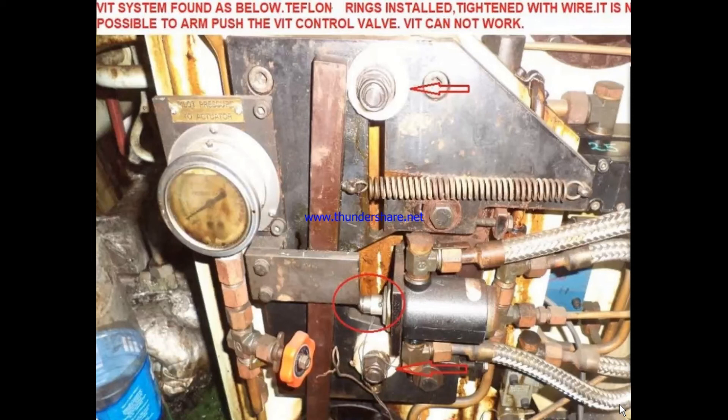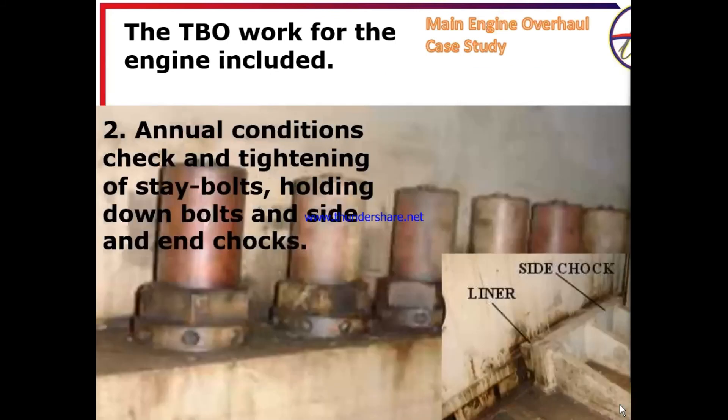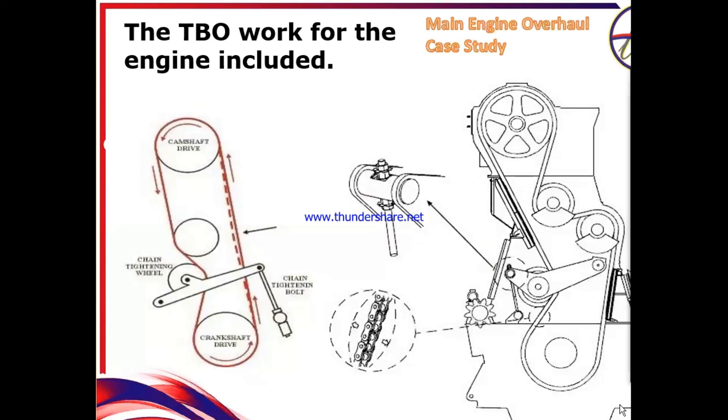In recent engines, this is also gone. They are completely relying on digitally set parameters. You can go and digitally set how many degrees before injection you want, and you can set for fuel oil. No adjustment of VIT is required other than setting the limit in your PLC circuit of a newer smart engine. These engines are very good because the thermal efficiency is a lot improved — the amount of fuel burned compared to the power given to the shaft is a much better ratio.